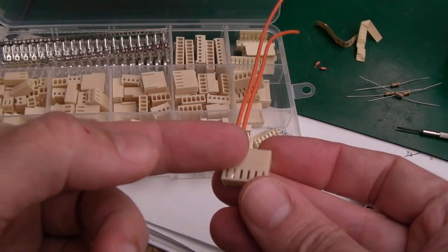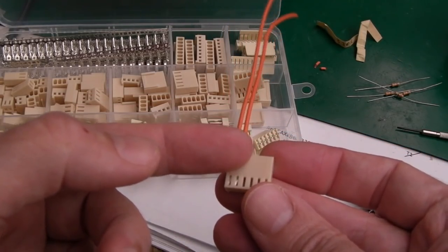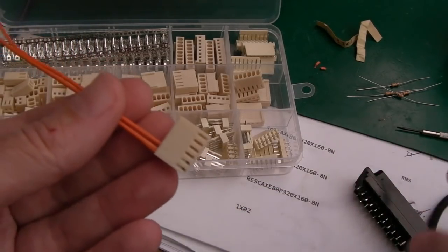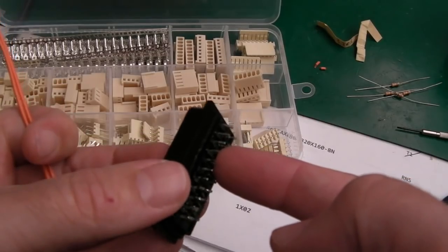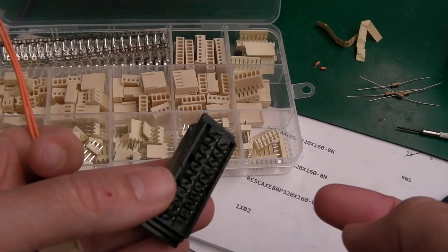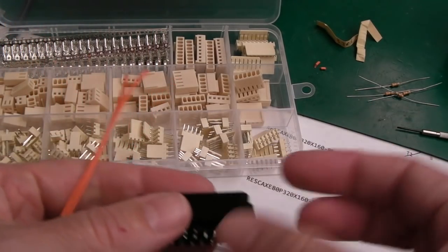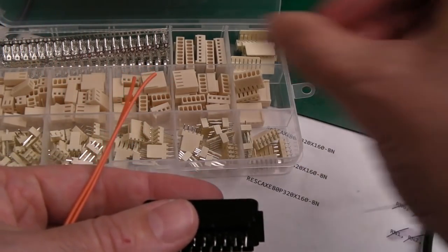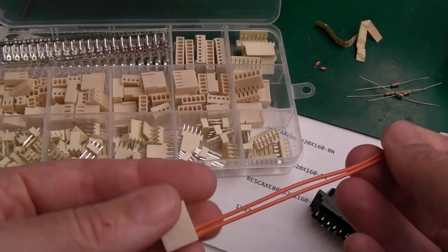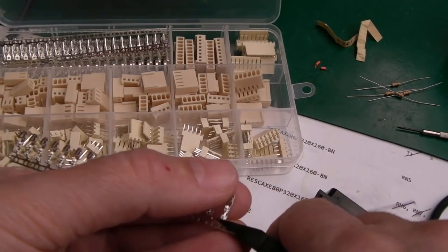Ultimately it's going to be red, green, blue, then sync and ground, and we obviously need to switch the TV into RGB mode. You saw right at the start there was a red wire - I soldered it via a 100 ohm resistor to the five volt rail. I'll do a similar thing but stick a little clip so you can clip onto somewhere on the board for the five volts through the resistor.